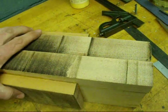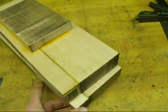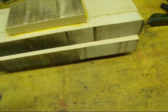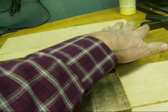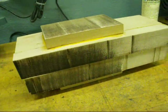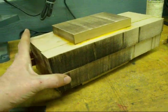The next thing I'm going to do is drill dowel holes right on the center line so that the two halves will come apart. I'm going to glue the two together first, then do that. In order for them to come apart after the turning has been done, I'll lay a sheet of paper — regular typing paper — in here, put glue on both halves, clamp it, let it set overnight, then drill those holes. After the whole project is done, I'll be able to stick a knife in there and pry the two pieces apart, but they'll be as one while we do our machining.